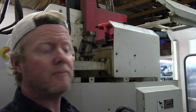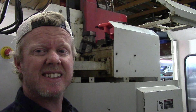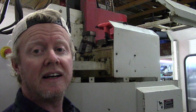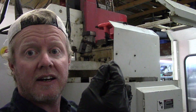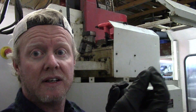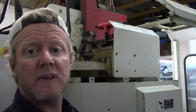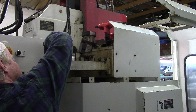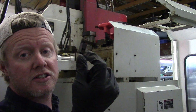I'll have to do a little bit of adjustment. I'm going to start off real slow and get the machine in a state where that is the only thing moving. I definitely don't want it to do a full cycle. That cylinder should move in and out with kind of a gentle kick. I'm going to adjust these little valves on the air fittings — they basically have a lock nut and a little thumb wheel, and you just screw them in and lock it down.